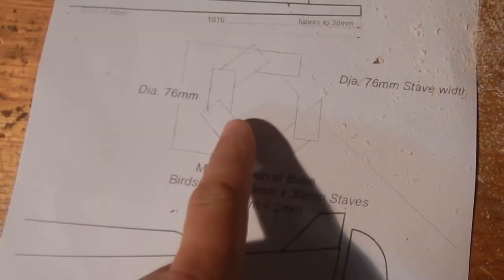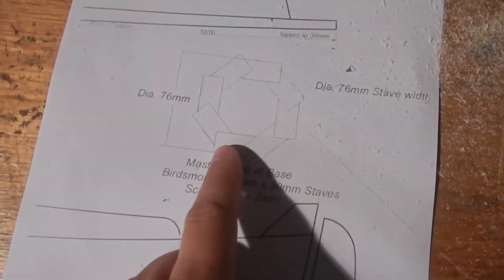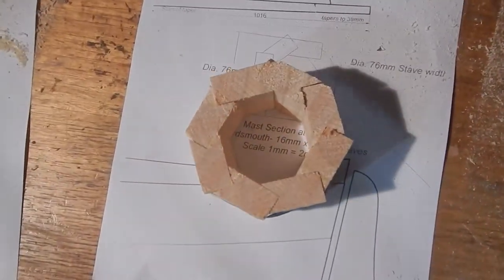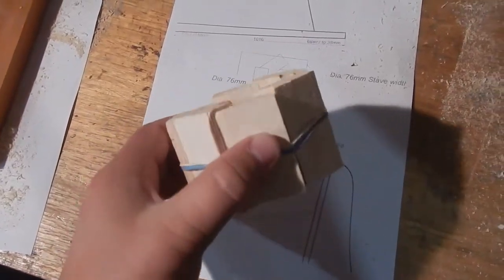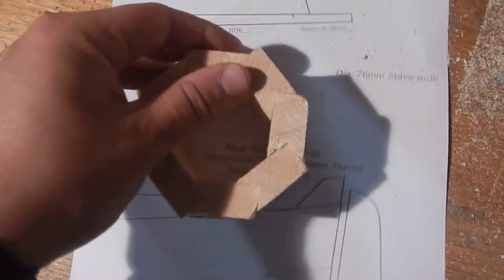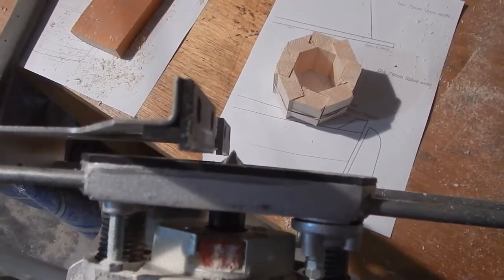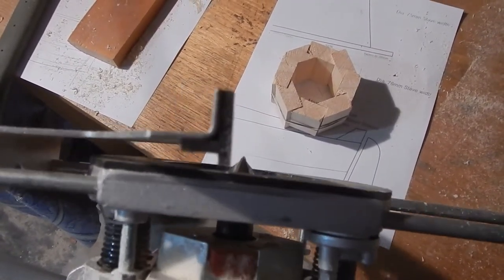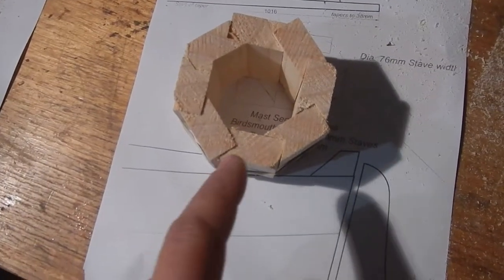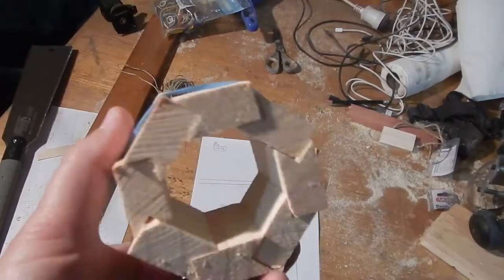I've been prototyping the basic cross-section of the mast. This is what I have: eight short pieces held together with a rubber band. I cut these pieces to size, then used a little V-groove router bit set with a guide at the right depth right at the edge, so when I run the router down the staves I get a V in them. They fit together — that's pretty much what the mast will be. I think that's a successful test.